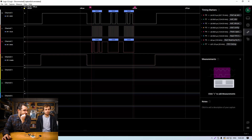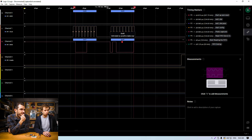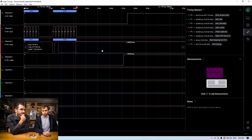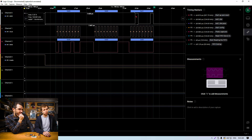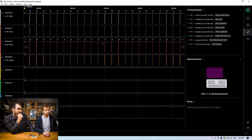In general with peripherals there's a setup phase and an activity phase — you set it up with the resolution or mode, and then you're basically just running the device saying 'give me pictures.' Plug the logic analyzer in and you can see all those transactions taking place — it should be no different between the Arduino and the MicroPython driver. Looking at the logic capture, before the Arduino driver did anything it initialized a reset: sending to register 87 with value 0x40, which just resets the camera. Then here's the wait idle command, constantly polling that message.